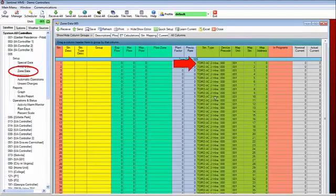Well, let's say I've got a site where I want stations 1 and 2 to correspond to the actual stations 1 and 2, but I want 3 and 4, because they're going to be irrigating shrubs or annuals or something different from 1 and 2, to start on station 25. Then, either from the faceplate or from the zone data, and it's obviously easier to do it at the zone data level because I can see the whole screen at one time, in the column map station I can move 3 to station 25 and I can move 4 to station 26.